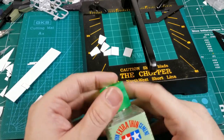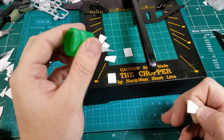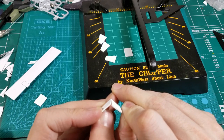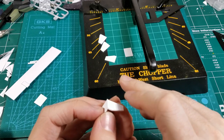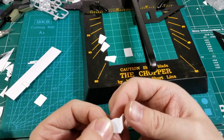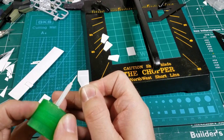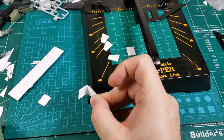The way I'm joining these together is with good old extra thin cement. Give the cement time to melt the plastic, and then do your best to align these straight and center. Give them a good squeeze, and run a little extra where they meet — inside and out.